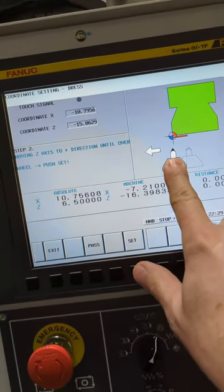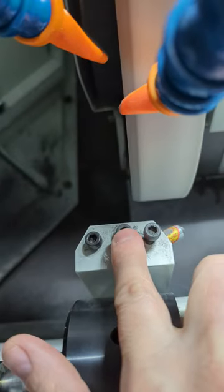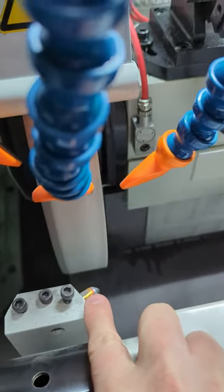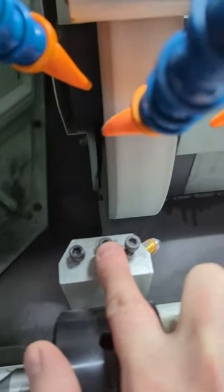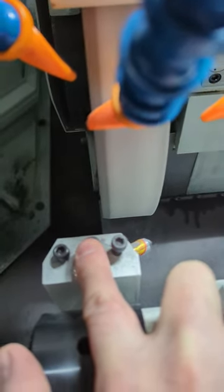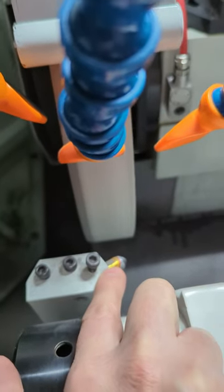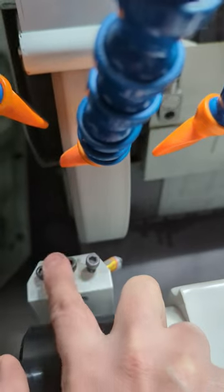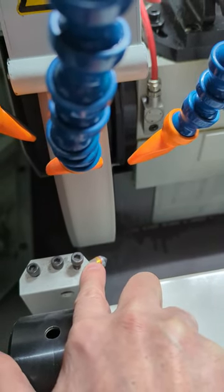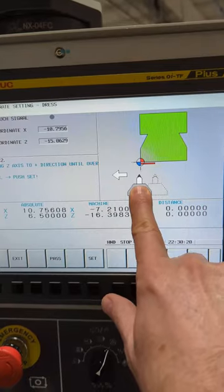You can see the first one is set pointing here. That would actually be this guy right here, but I don't have one. I'm only profiling with one diamond because I didn't want any kind of blend mismatch. If you were to do a profile on a wheel like I am, this is a pretty simple profile, understand that. But this diamond here will do a lot more dressing than this guy will. This guy's going to dress a taper. This diamond will wear faster, so you'll have some blend mismatch, even if you have it right from the beginning. Eventually you'll have some mismatch, so having just one reduces that quite a bit. So pay attention to the orientation of the diamond.